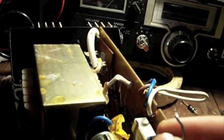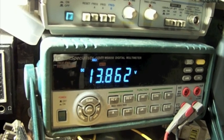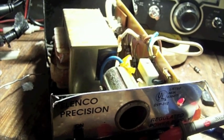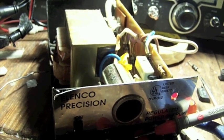Even though these diodes are salvaged, they're perfectly good. That's why when I throw away something electronic, I always try to salvage as many parts as I can. Back there is the fuse — I actually managed to find another fuse of the correct value. It's a little too short for the holder but it does snap in and works fine. Over here on the meter you can see the voltage: 13.8 volts, which is perfect. The voltage was a little low, so I turned the trimmer to bring it back up. There it is completed — I just got to put the top back on. I hope this video helps if you have this fuse blowing problem with any power supply. This applies to more than just this type — this procedure has helped me repair LCD TVs and more. I hope any of this information helps, and thanks for watching.